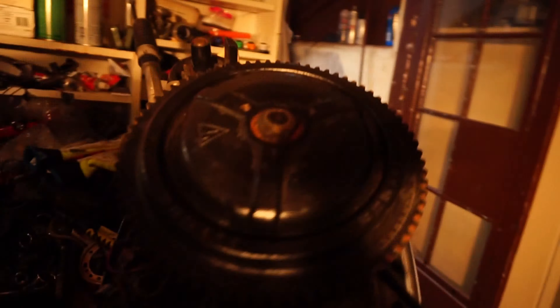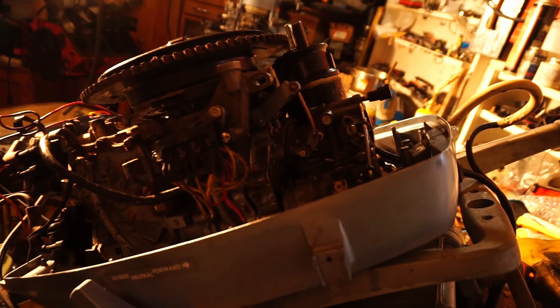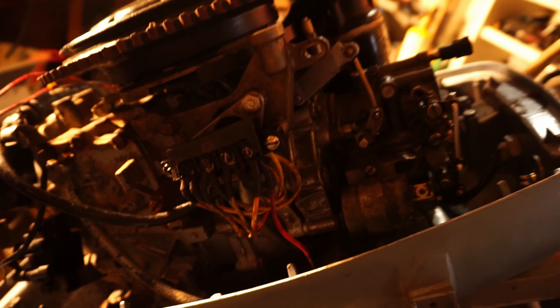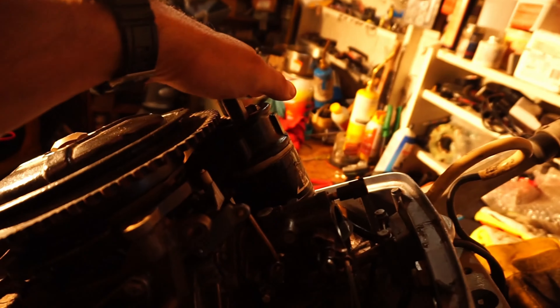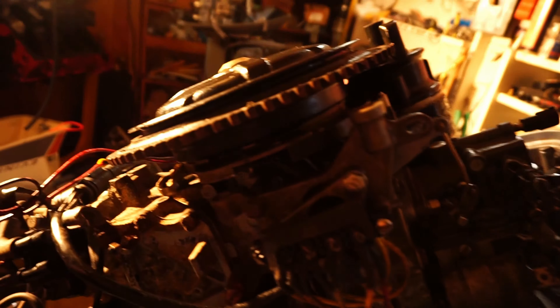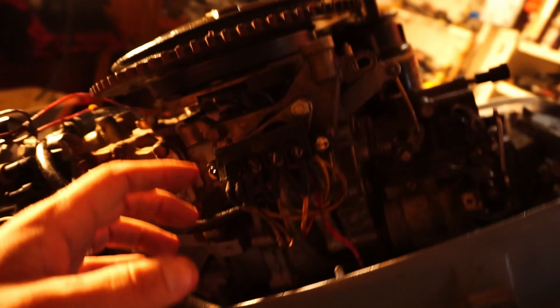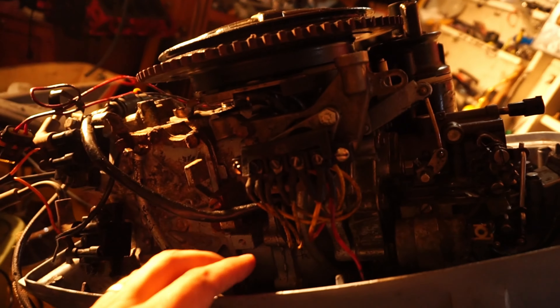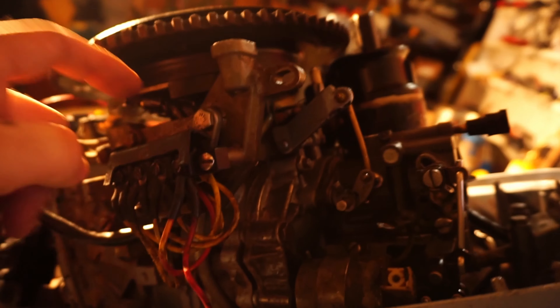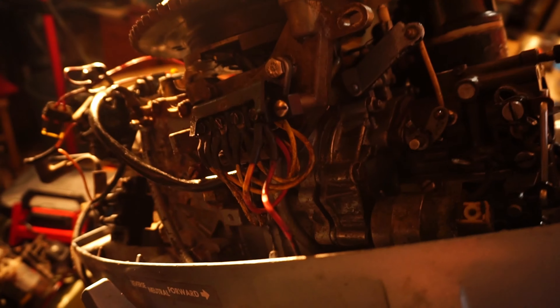It doesn't run yet so we don't know if the kill switch works, but we will find that out soon. Let's move over to the rectifier. Let me tribute Brandon's Garage and Cody Bass — they do a lot of work on these type of motors, the 35s, 25s, 70s, 80s, 90s, motors that have a rectifier and a starter. The rectifier is easy enough. There are three wires that hook up — you take the same color-coded wires: yellow with blue stripe, yellow straight, and yellow with whatever stripe, and hook them up together. The X-factor is the power lead, which goes from the rectifier here. Another wire runs underneath to the solenoid — it's the same power switch to the battery that hooks up the start switch.